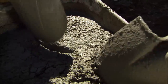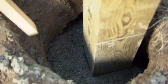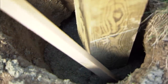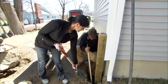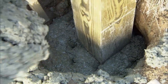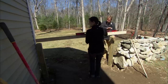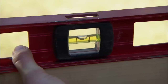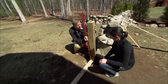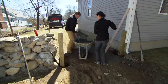Let's get that concrete in the hole. You've got to remember to fill all the way around it evenly. I'm just going to use this wooden stake to make sure it's packed all the way around the post. I want to fill the hole up until the concrete's three inches below grade. The ground drops off going over to the second post, so we have to use a board and a level to make sure the two tops are at the same height. We'll plumb up the post, and then we'll use a spacer to give us the exact measurement we need for our new gate.